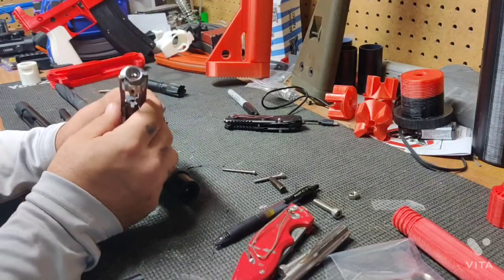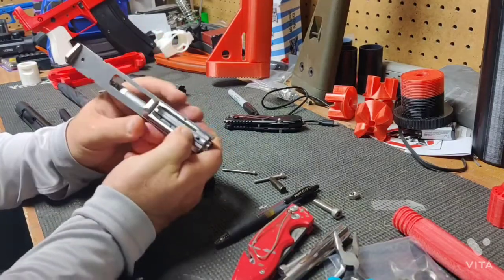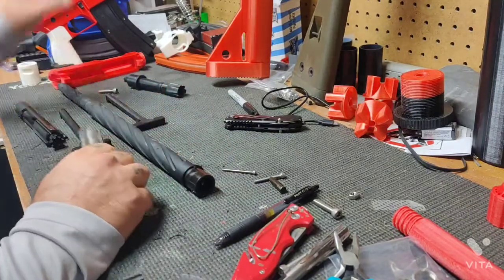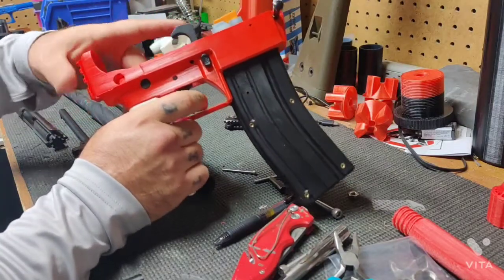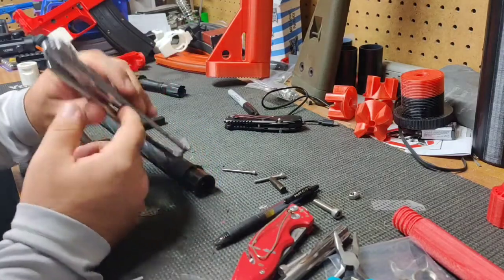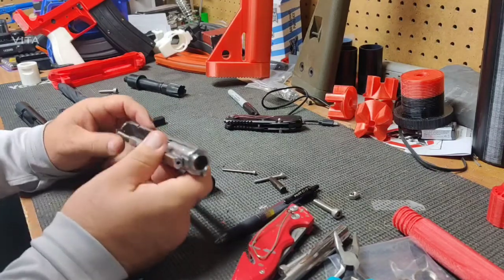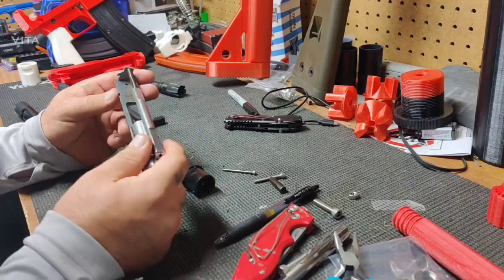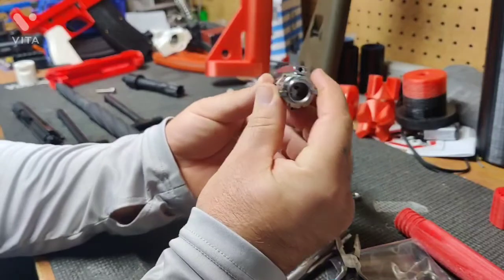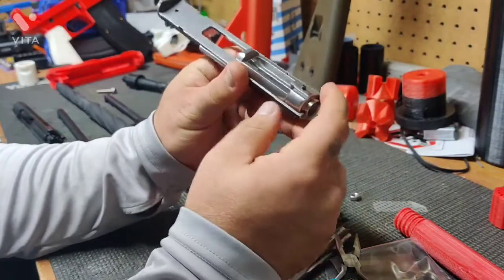As far as the complexity of these, they're pretty simple. Your firing pin sits in right here. When you pull the trigger, your hammer comes up, hits the backside of the firing pin, the firing pin overpowers the spring, comes forward, and hits your cartridge to set the round off. You can see that a large portion of this body is a tube on top that has been TIG welded to the main body of the bolt carrier.